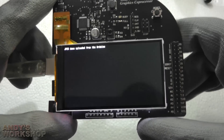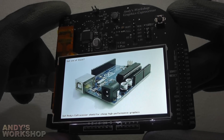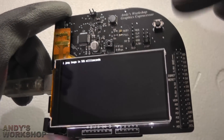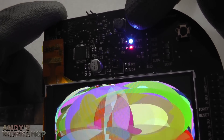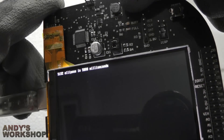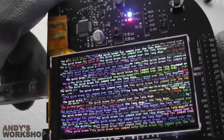We're going to see a JPEG first — there we go, it's loaded up and demonstrated on screen. I'm not going to go through this entire demo because you can see it in one of my other videos on YouTube. You can see as the graphics demo runs, the LEDs are lighting to indicate progress. The busy LED is going mad because the graphics are being pushed out at high speed, and occasionally the full LED blinks to indicate that the circular buffer has filled and it's waiting for the STM32 to clear some space.